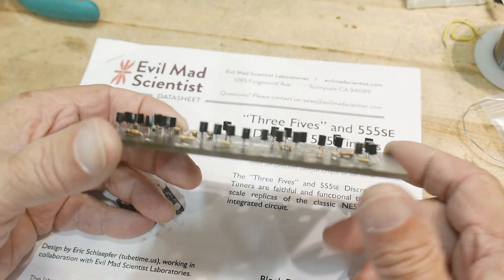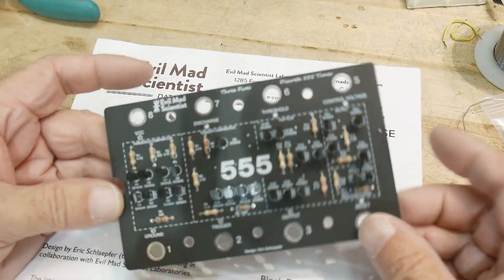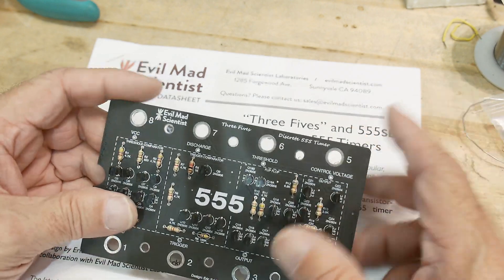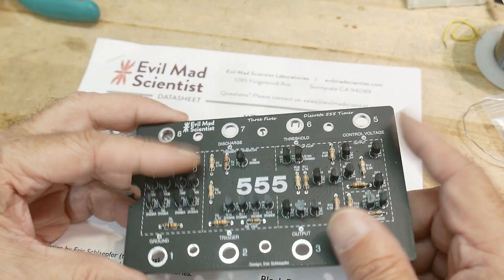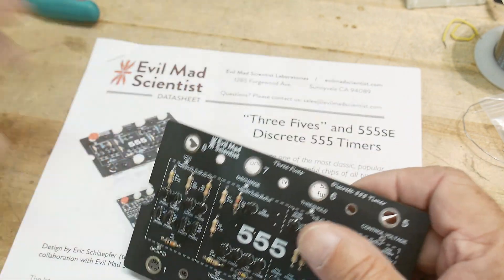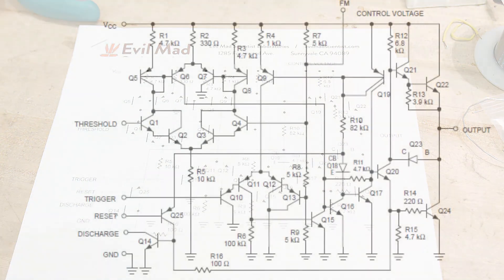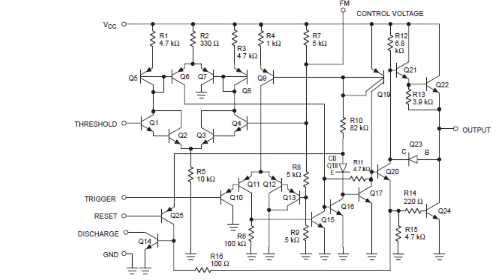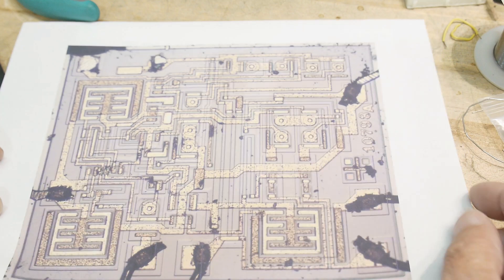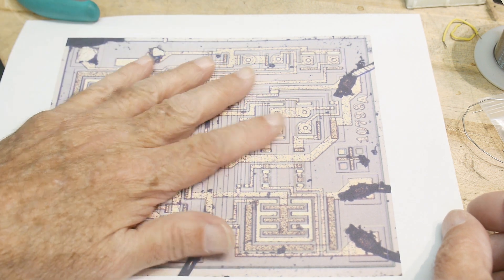It's 24 transistors. Now, some people may think that's just a real simplified version of it, that the 555 is much more sophisticated — that it uses real comparators and all this other stuff. No, it doesn't. This is a schematic of a real 555 from a datasheet, and it's 24 transistors. And if you don't believe that, you can actually look at a photograph of the die and count them — there are 24 transistors. That's all there is on this thing. It's very simple.